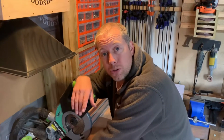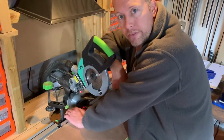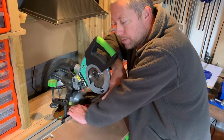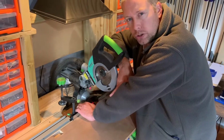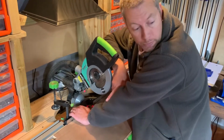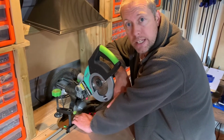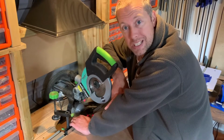Okay folks, so now we are on to the seat. So again, that leftover wood that we haven't used, I'll be able to use it for the seat. So this is 1 inch ply, so that'll be good and sturdy. So we'll cut her down. 39.5 is our width, and then we'll set it in. The reason we're doing the base of the seat now is once we put the aviation ply on, there is no way we'll be able to slide the seat through.